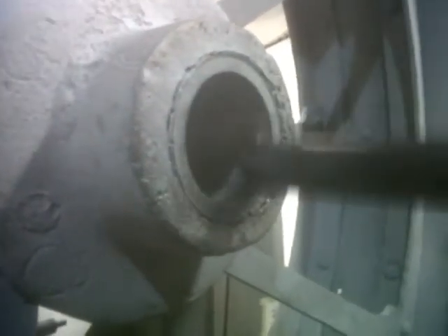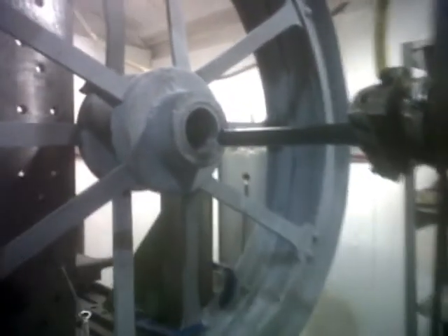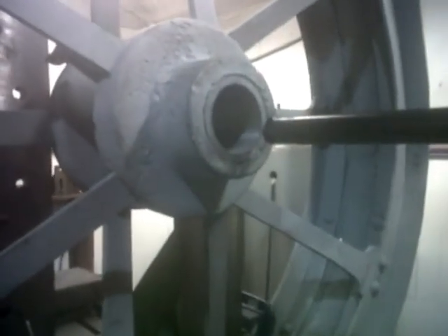Just coming towards the end of its run there — you can see the distance it's moved and how it's wound out. We're cutting this dry, so I'll just blow a bit of compressed air down here now and again to clear the cuttings. It's a very, very fine cut — there's virtually nothing coming out of that. We're on the final cleaning cut anyway, so it's an even finer cut than usual, barely taking anything out at all. There we are, it's come to the end of its run. All cleaned out — nice smooth tapered bore.